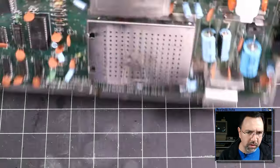Now, I mentioned this before, but the dead test cartridge runs in Ultimax mode, so it does not need the CIAs, the BASIC, KERNAL or character ROMs to be working, and doesn't need the SID. All it really needs to be working is the CPU, the VIC, the PLA, and there's 4K of RAM in Ultimax mode that's required. But none of that matters if you just get a black screen. We need to dig in a little bit deeper.